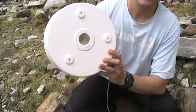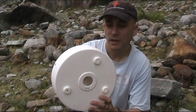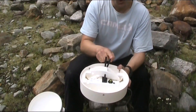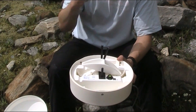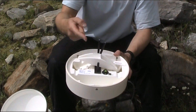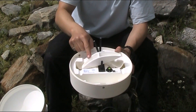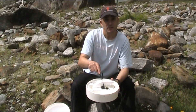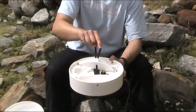The water then drains away into the base of the gauge. You can see there are holes in the base with a coarse mesh to allow the water to drain away. Once it tips, the other bucket is now underneath the spout coming down from the funnel. If it continues to rain, that bucket will fill up, the weight of the water reaches the threshold, and the bucket tips again — continuing for as long as the rainstorm continues.